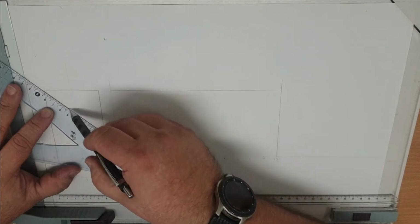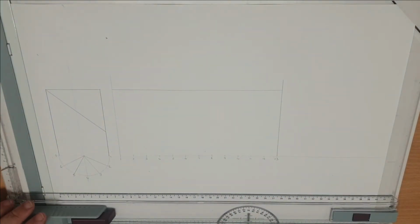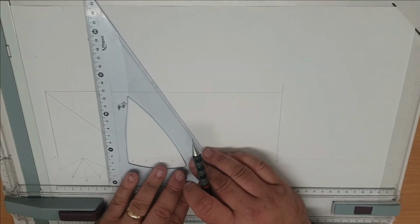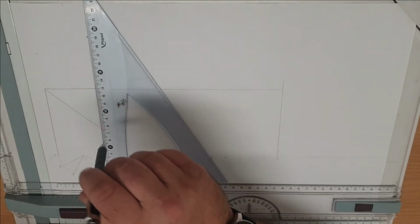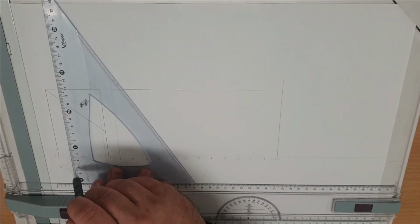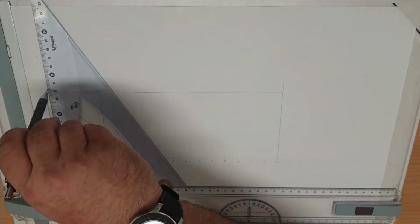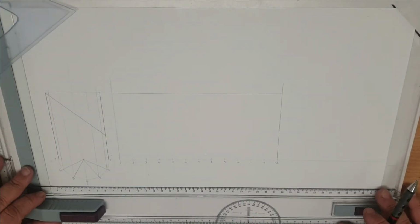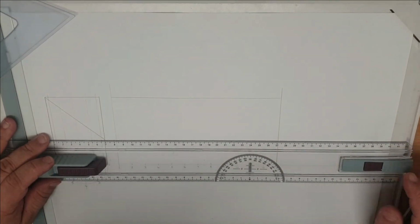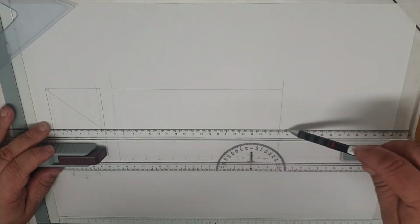So if our cylinder was chopped with a slight angle, if we were adding these together to obviously make a 90-degree or a 30-degree bend or various bends, so we'll cut through and intersect our cylinder. So now we take the lines from where our segments intersect the outside of the circle, we bring those lines vertically through the whole pattern. And where those lines intersect our cut through, we then take horizontal lines across from each one of those.